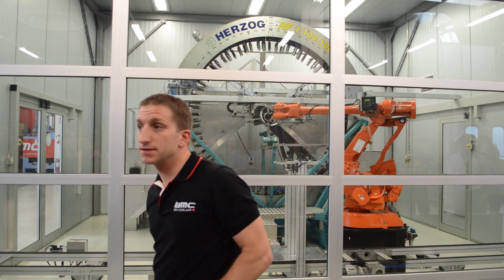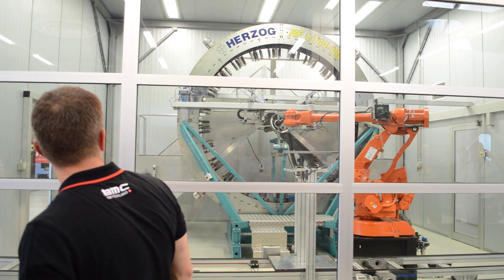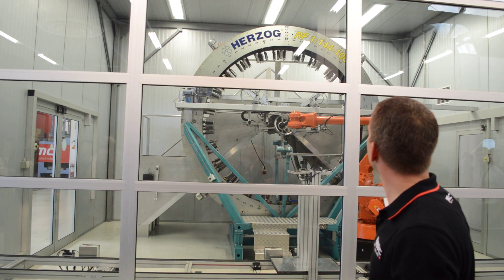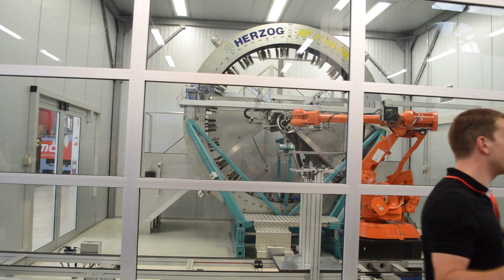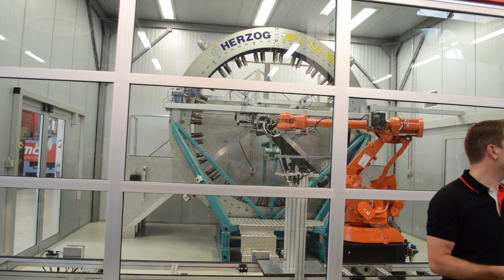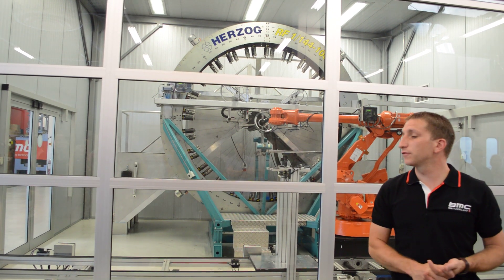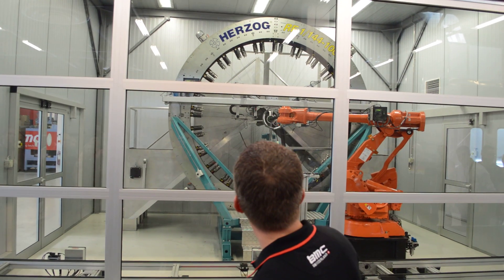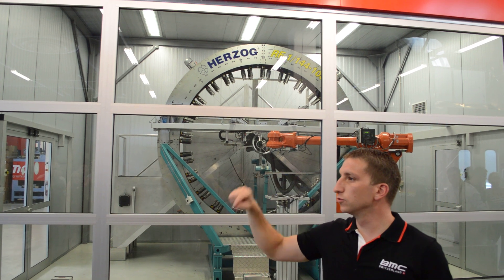Now the last layer is applied and you will see the glue gun soon. Each individual tube — down tube, top tube, chain stay, seat stay, all the tubes — has a specific optimized program regarding speed, how many layers, and what the angles are, in order to have the best performance for the product. This is the glue gun applying the glue. You can see the mandrel is turned, making a glue seam.